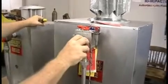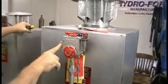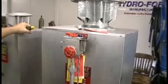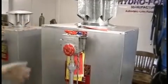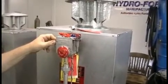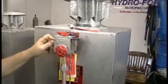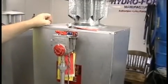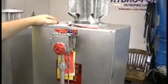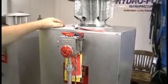So what we do to get the heater to actually perform better, we run a larger line to the heater. It's a 1 inch tube, and that increases the performance of the heater. It allows this heater to maintain 240 degrees on a 10 flow wand at 500 and 600 pounds. That's plenty hot enough. We don't need any more volume of water. It'll also maintain 220 on a spinner with 202 jets at 1300 psi, it'll maintain 220 under those conditions at that pressure. So the performance of the heater is extremely good.